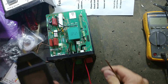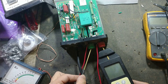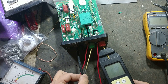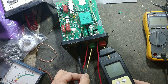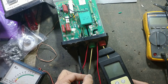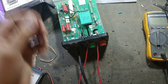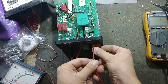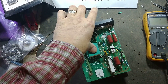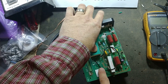I'll turn this meter on and clip it over the joules. There it is — about two joules, bouncing between 1.7 and 2.4, so it's a little all over the place. But we increased it by quite a bit — we went from 1.3 to 1.4 up to 1.6 to 2 joules. It did increase, so I'm probably going to keep it in there. It's a pretty good jump for not too expensive a part. The voltage didn't really change because voltage comes from your transformer, not the capacitor. That's pretty slick — I want to start offering that to other customers who want to upgrade and increase the power output of their unit.